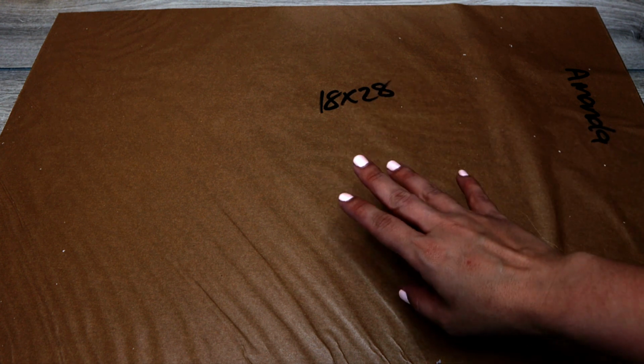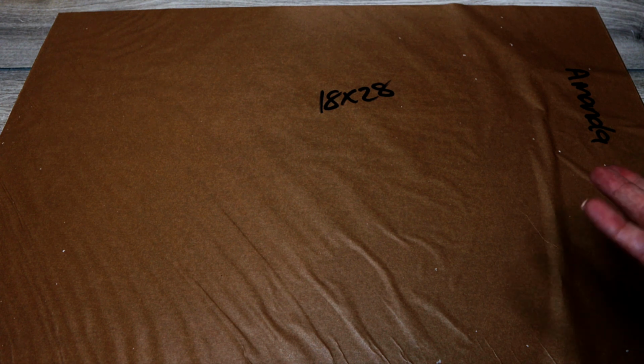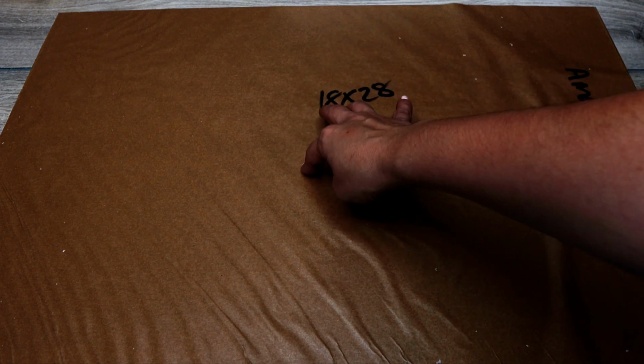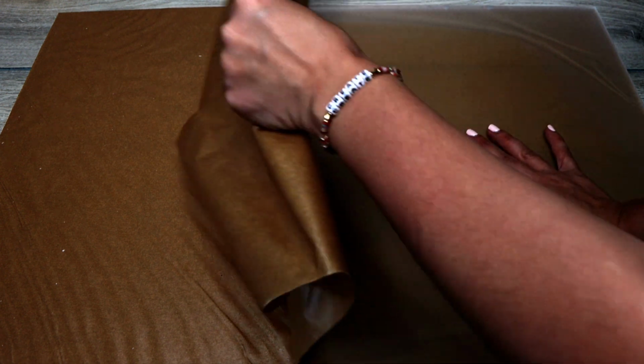Okay, so this is a 1/4 inch double-sided frosted acrylic. And if you notice, the masking for whatever reason is coming off. So that's a fire hazard waiting to happen. So I'm definitely gonna peel off the masking tape. And then I'm going to find the center and mark the center point, and then I'll take it over to the laser and score it. I think what I'm going to do though is leave the backer on for now just so I can keep the back as clean as possible, and then I'll peel it off at the very end.